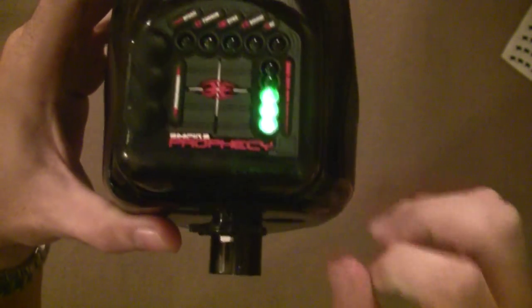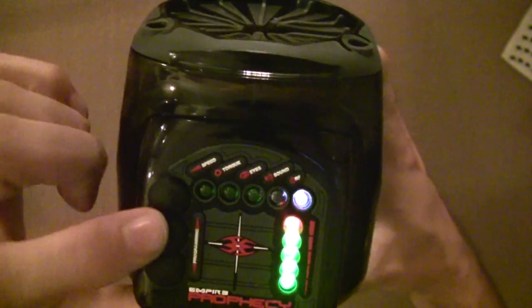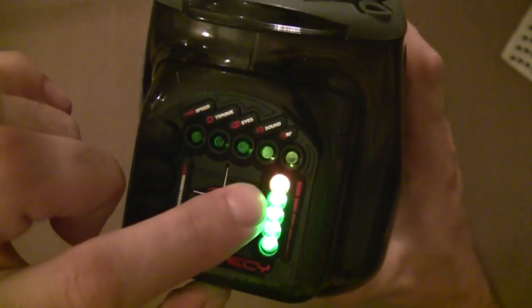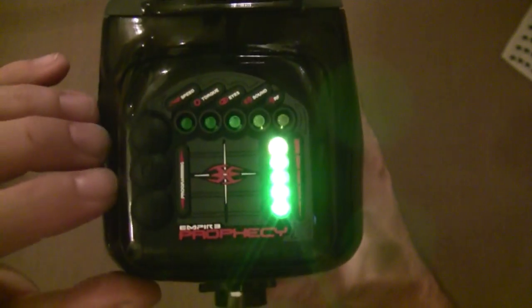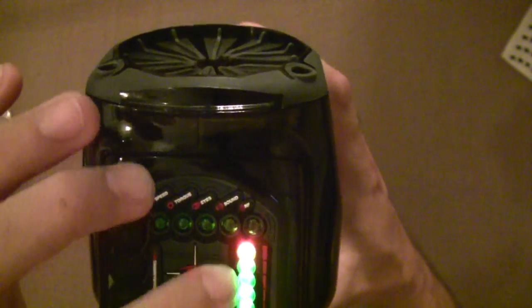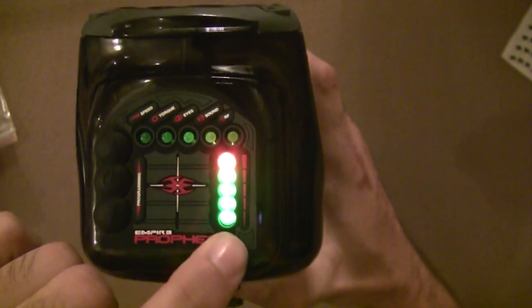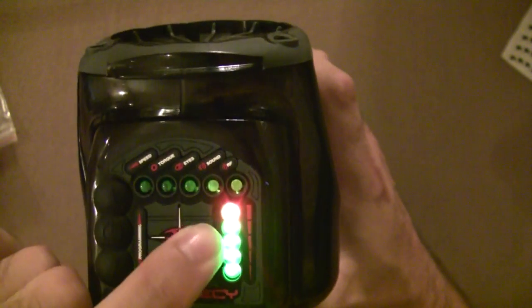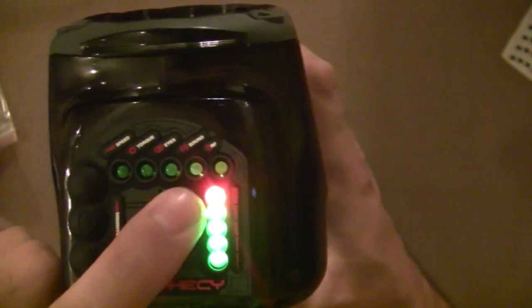Push down, it goes in reverse, looks for a sound signal, and I give it a sound signal. Now it's looking for an RF signal. If I want to default it and just go past any of the signals, I can push the power button, and in that case the LED at the top went orange instead of red, which means I defaulted that test. So that gives me four green LEDs and one orange LED: the feed-neck sensor's working, the feed gear's working, the feed carrier sensor's working, sound activation's working, and I didn't have an RF chip set up, so I couldn't give it an RF signal.